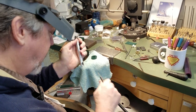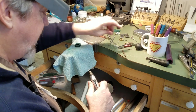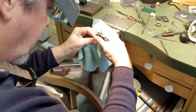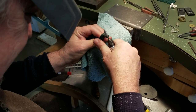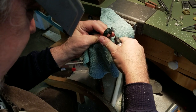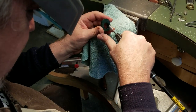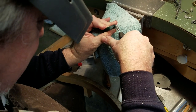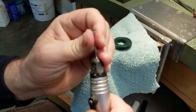Once you get this two-dimensionally what you want, you can easily take the same tool and put it in here. Now if you put your thumb on the ring, you can get some speed up and start shaping your piece. We're doing like a little dome here — you can start shaping a little bit at a time. If you want to put a little bevel on the inside you can do that. You can also use this to cut grooves into a ring. There's so much I can do with this — I use this tool just a tremendous amount.